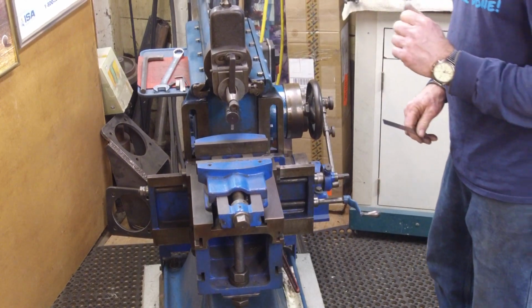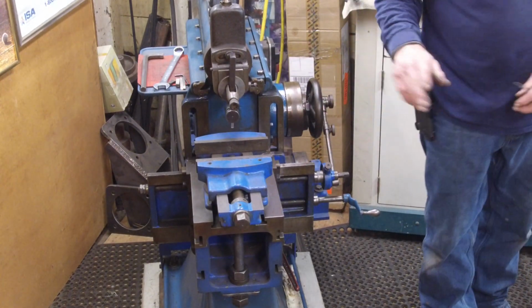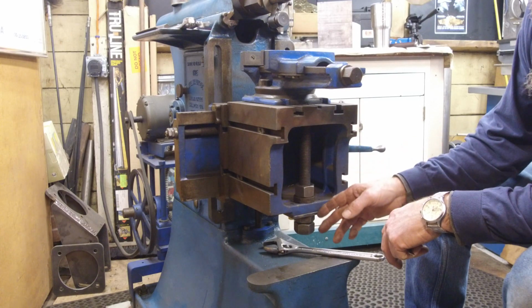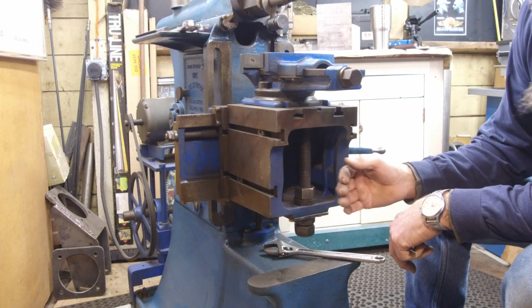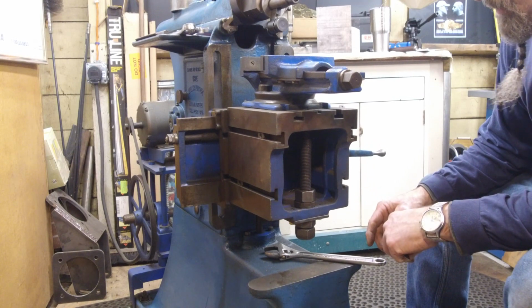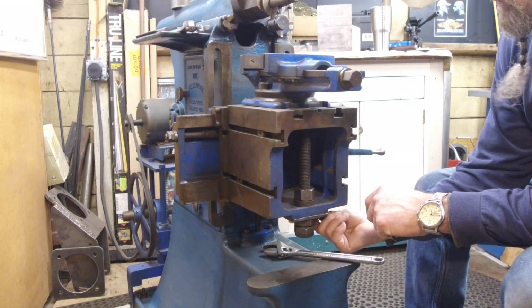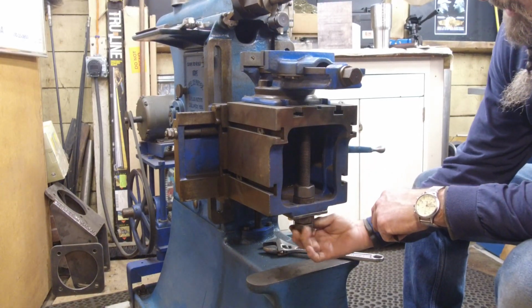All right. So you can already see that I have to lower the table down. So let me bring you into a better position to watch the setup. Okay, right after I cut that material and I started realizing I had to drop this down, I brought this down, and this jam nut was underneath here for the last setup when we were working that keyway in the bore of that giant fan we were doing a year or so ago. I first made this rest, and this is faced off with the travel here, and this is a weldment nut here, 2 bolts, 3/8 bolts, go up through here. 9/16 is the head size, so that's where my head was at.